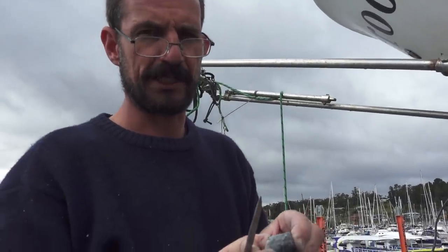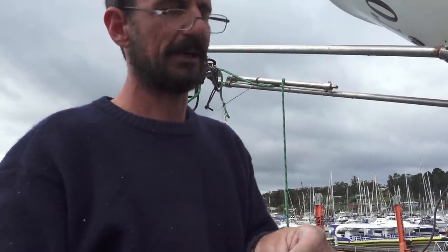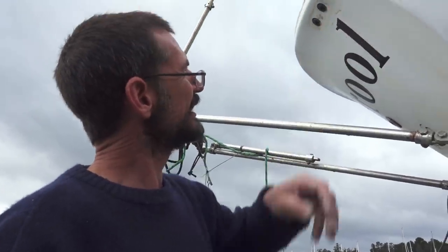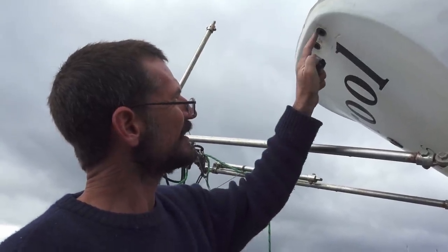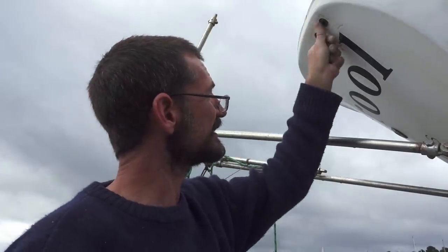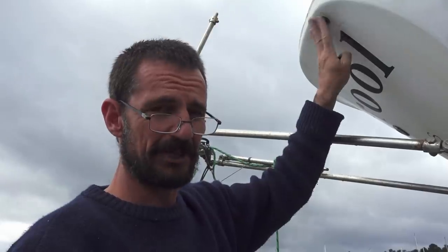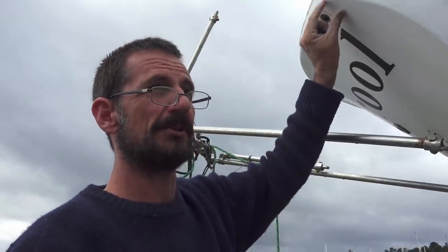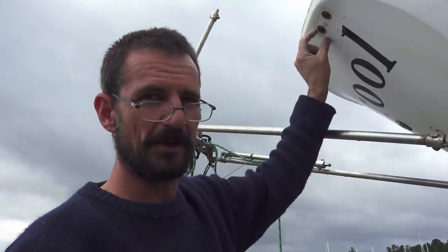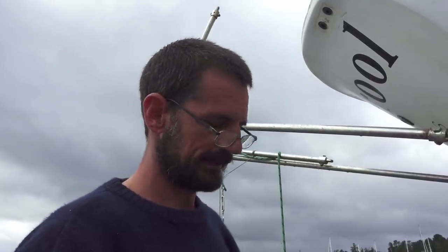It's a bit like when you're putting epoxy on epoxy where you have to rough up and key the surface — so it's stuck pretty well. We've glued it in here into that hole and it's nicely bogged in the top. The next stage is we'll pack this and make it flush with the deck, and then I'm going to lay up some strong double bias glass on the back here. Then we'll move on to the next phase of our new backstay chain plates — something a little bit different.